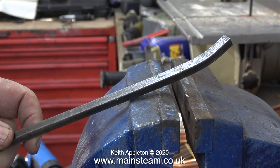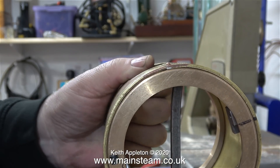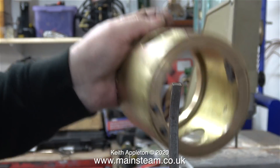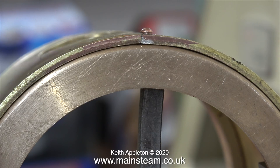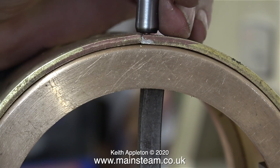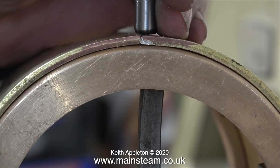Help is at hand. Find yourself a piece of steel like this and bend the end of it, and clamp it very tightly in the vise jaws in such a position that the smokebox sits on top of the jaws. I'm going to use the rivet snap on the outside, but first of all it's very important to position the rivet right in the centre of the piece of steel.